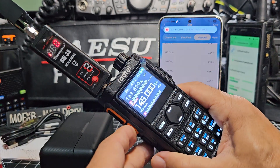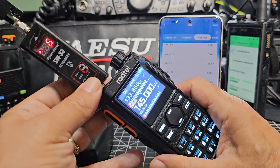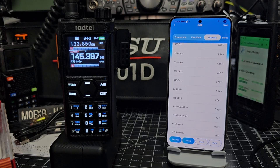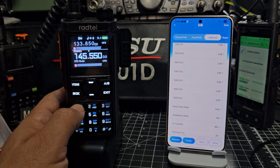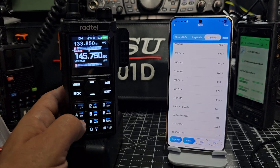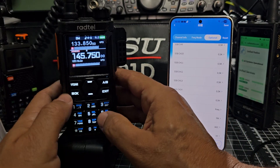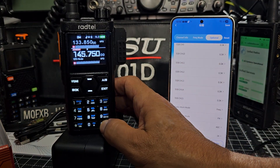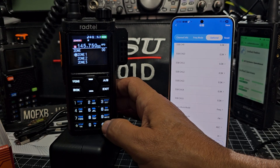It did actually TX, although you need to test the harmonics on that. Let's get my little power tester on there. 4.6 watts — that's okay, about right. It's advertised as a five watt radio. Another nice thing: all the buttons are shortcuts. Press and hold scan, it starts to scan. You can change the frequency step. You've got memory step, power, squelch, dual watch, tone, duplex shift, DTMF — all on the front. FM and the band scope as well.